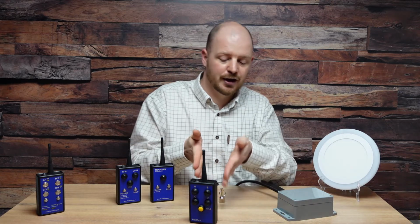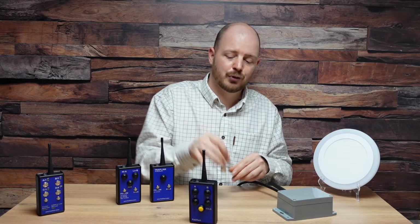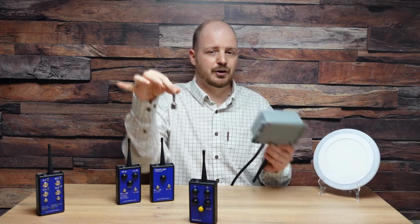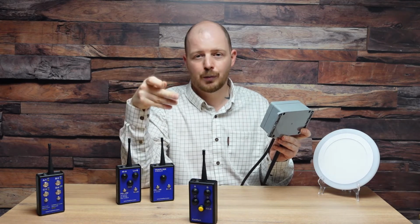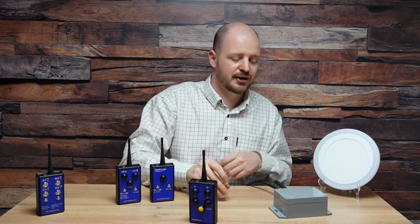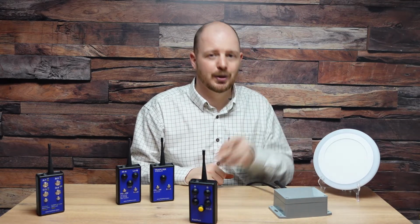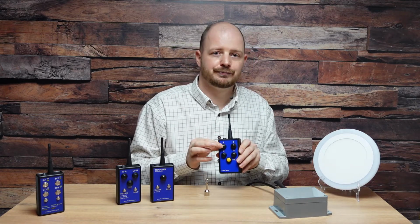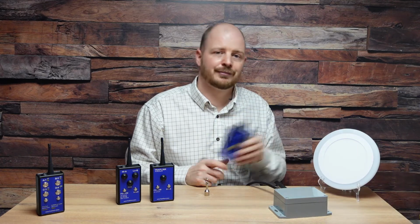If not, you'll hear a long beep to signify it's exited the mode, but to program, every remote control comes with a keyring. Take the keyring, wave it across the top of the receiver. The remote control beeps twice to confirm that it's now programmed. Simple as that. No tools needed out in the field. There's no need to take the lid off the receivers. Just keep your magnetic tool handy and wave it across the top of the receivers to program. Simple as that.